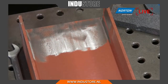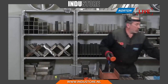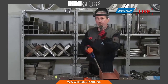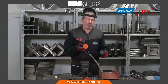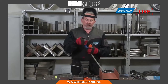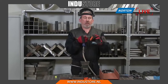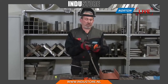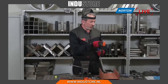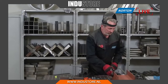Yeah, easy, like you say, Robin. With this, and I've chosen this backing pad on purpose, I could, in fact, on the flat areas, have used a larger backup pad, which will help give us more aggression with the product. But I like to use a small backup pad like this, because then I can use this side of the disc, the periphery of the disc, and the flat edge of the disc. So proper 3D product. I can use any area on that product without any issues. Okay, so again, really fast and efficient at taking that off.